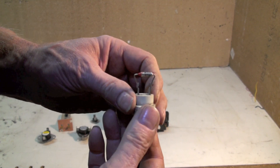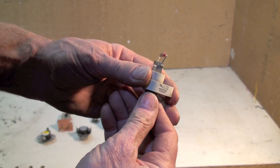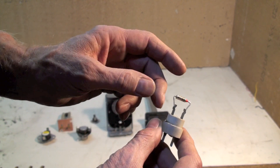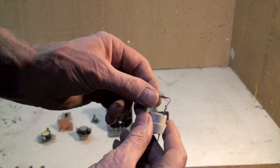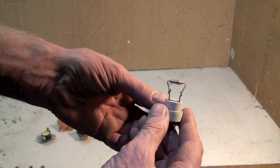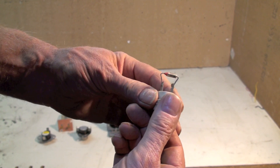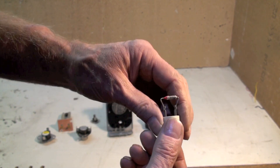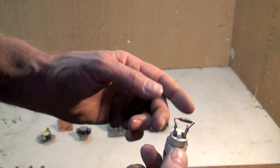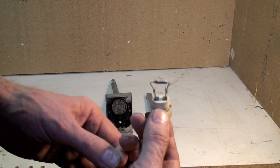This one here is a fuse. It could be mounted in the airflow, so if the airflow got very hot, this fuse will blow. Now this fuse does not blow with power running through it — it blows with temperature. If it gets very hot, this is going to blow and it does not reset. Wires fit here. This means someone has to come out and replace this part, and hopefully when they come to replace it, they will find out why this thing kicked off.